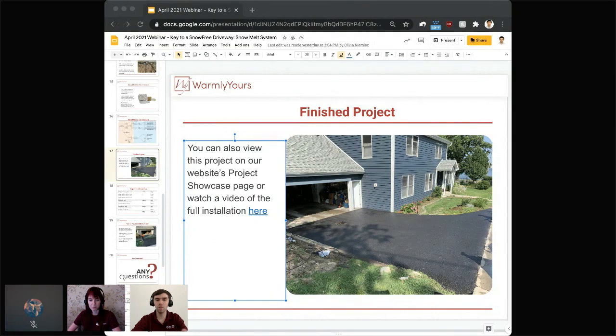and it's fully encapsulated where nothing is shifting, and your structure and base are not moving around, it's typically going to just outlast the driveway. So by the time the driveway reaches the end of its lifespan, 10, 15 years, whatever it is, it's going to be time to replace the driveway. Your system should still be in great shape, but most likely will need to be removed at this point if you're planning a whole overhaul of your driveway. So again, it's a really great lifespan that usually just outlasts the driveway.